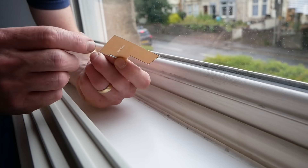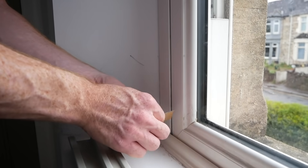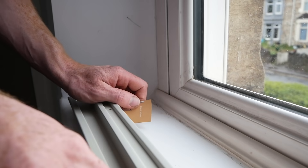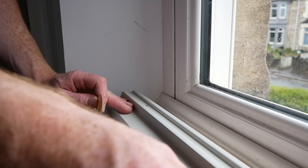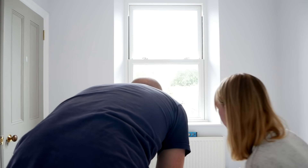It's the bottom section — they're all identical profiles. What we had to do is cut a notch out the back to sit over the trim. Normally you wouldn't have to do this. At the bottom of the bars this bit steps out, so I've just notched out the back so that our bottom frame now sits tight against the frame of the window.